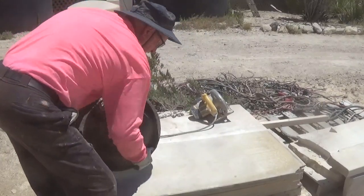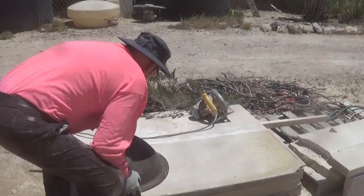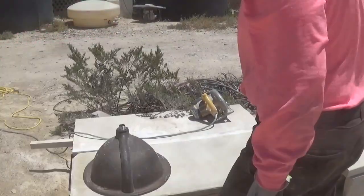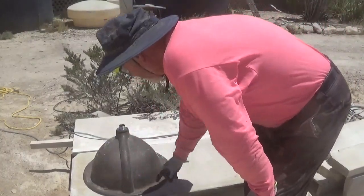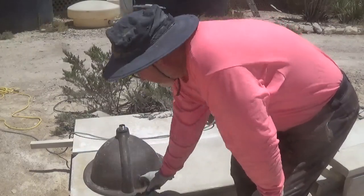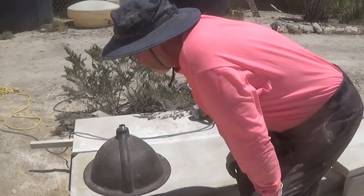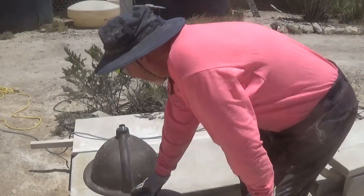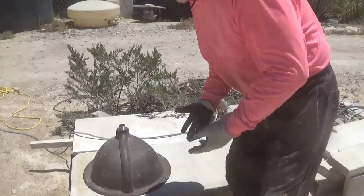So we're going to put it here. We want to hold it to the top. Now that looks about right, but it is going to be very weak. I have to trace around here, then trace in — it looks like three-quarters of an inch. Ordinarily you would use a scribe or a compass and just scribe around it. We've looked everywhere and can't find my scribes, so I'm going to go ahead and carry it at three-quarters of an inch in visually, to be safe. Then it'll be a drop-in sink, so it'll just drop right into this slab — if I don't break the slab as I cut.